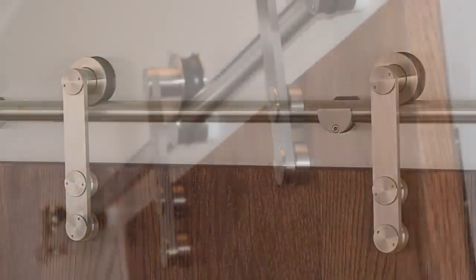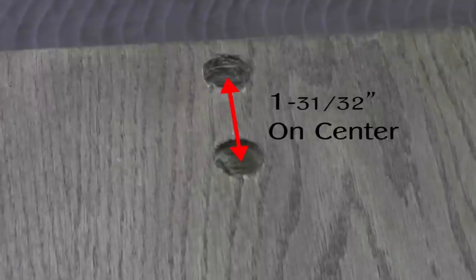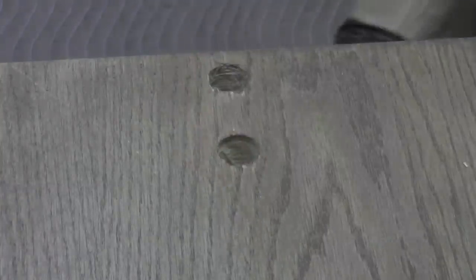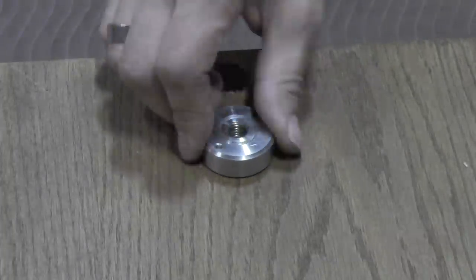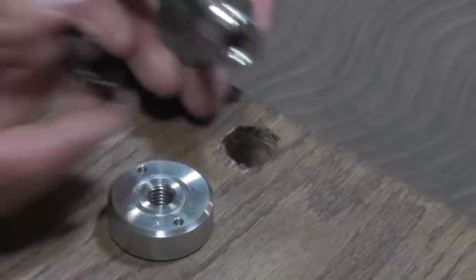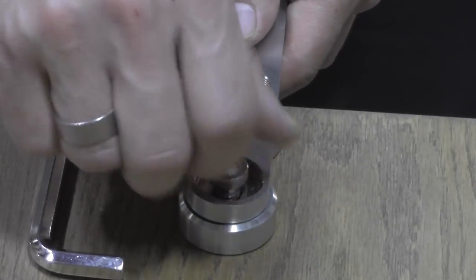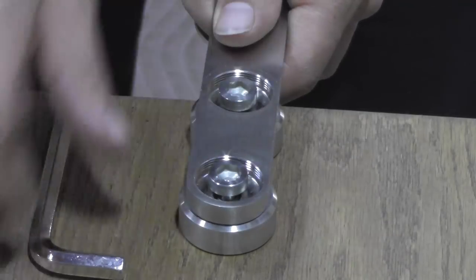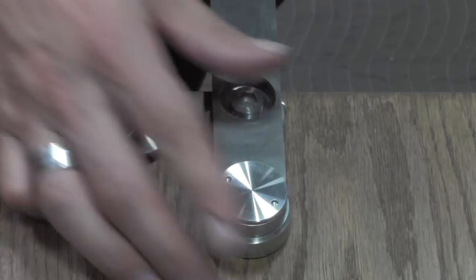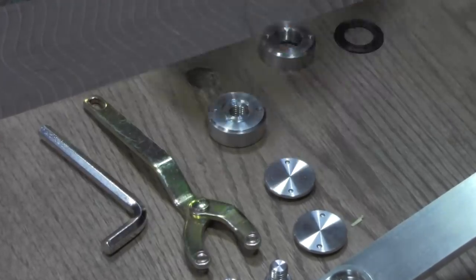Now we will fasten the brackets. The spacing for your brackets is dependent largely on the width of your door, so measure accordingly and space evenly. The holes on either side are to be drilled at 1 and 31/32 inches apart on center. Insert the pin with a washer through either one of the openings and attach a washer to the top side, then tighten down the nut. Use the spanner wrench provided to tighten the surface plate and then repeat these steps. After fastening both pins, position your bracket over the threaded nuts and secure in place with the screws provided into the top side of each nut with the hex key provided. After the entire assembly is tightened, screw the cap covers into place and tighten down with the spanner wrench once again to conceal the hardware. Repeat these steps for both brackets and your door hardware will be nearly complete.